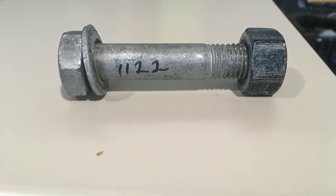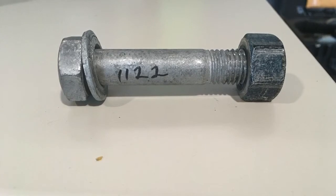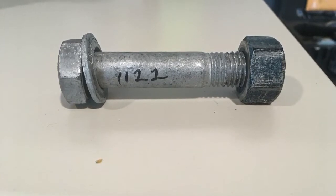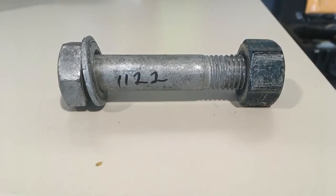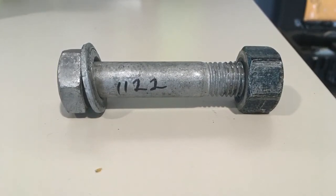We test two bolt assemblies per lot assembly. If you have all the same lot bolts, same lot washers, and same lot nuts, then you've got one assembly. If you change up and add another lot of washers, you've now doubled your testing.